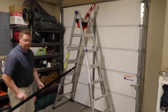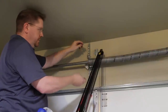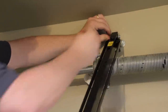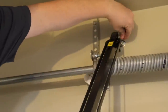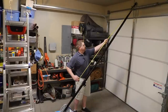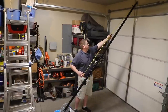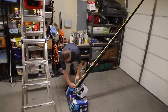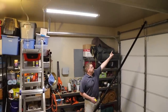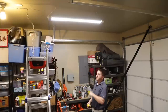Our next step is to install the door end of the rail up into the bracket we put up at the top of the door. This is attached with a clevis pin and a small ring that goes through to lock it in place. Line up the rail with the bracket, push the clevis pin straight through, and then the ring goes through the hole in the small end of the clevis pin to lock it. Then measure the distance from the end of the rail to the center mounting hole in the bracket — in my case that's 130 inches — and measure that same distance from the wall along the ceiling to find exactly where the center of the motor will fall.